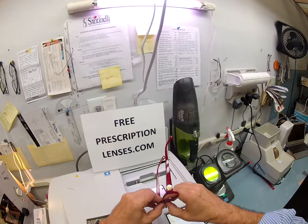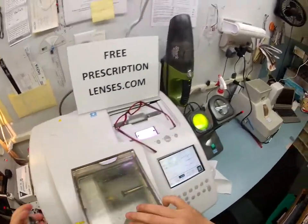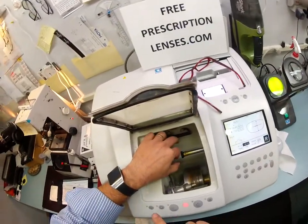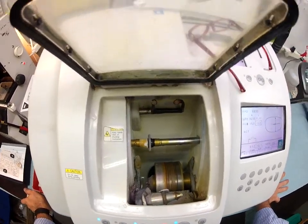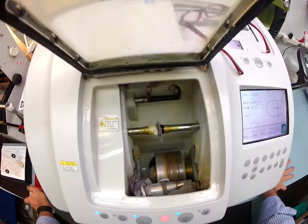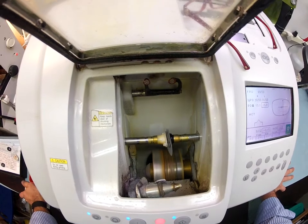Let's see if it fits. I'll tuck it in at the outside corner first, then using my thumbs press down at the nose. It does not fit — I'm going to take it down a tenth of a millimeter. I programmed the machine to start a little bit large because you can always cut more off a lens but can never add it back on. The right lens takes a little bit longer; once I have the size just right I'll flip it over and cut the left.